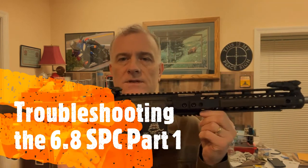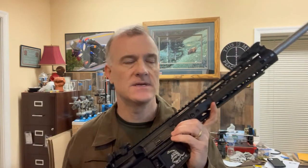This is going to be the first in a series of videos dedicated to trying to figure out how to get my 6.8 SPC AR-15 carbine to cycle properly. Right now the bolt catch will catch on the face of the carrier and not the face of the bolt. That's why it doesn't work, because it may not strip the next round out of the magazine, or if it won't hold up far enough to swap out another magazine and hit the bolt catch, the bolt will ride over the magazine, and so it's not working correctly.